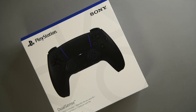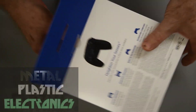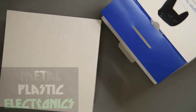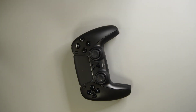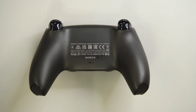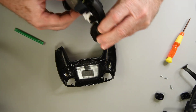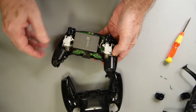In the last video, I was focused on the watt hour readings I was getting from the test battery. With the equipment I have, I was hoping to get an accuracy of plus or minus 2%, with the assumption that the average of my meters will be within 1% of the true value. That will be close enough to evaluate the batteries I will be testing. When comparing battery to battery, that will be much more accurate — the actual watt hour results might be up to 2% different than my measured value, but I expect battery-to-battery tests to be well under 1% error.